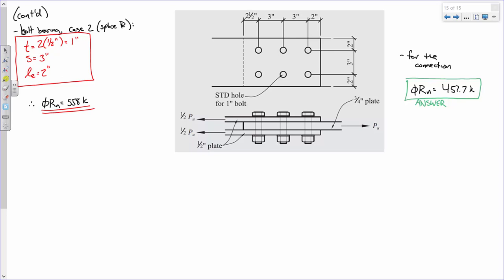I'm not making you do that, and I'm not going to make you do that on homework assignments. We've already been through tension members. It's time to move on. But I want you to recognize that there's oodles of different limit states for this connection that would be relevant. Because what if the gross section yielding capacity is like 250 kips? Well, that means we're going to fail this before any of this happens, right? Now, that might be fine if your load's only 240. But you're never going to know that until you go through and check it all. Sound good?